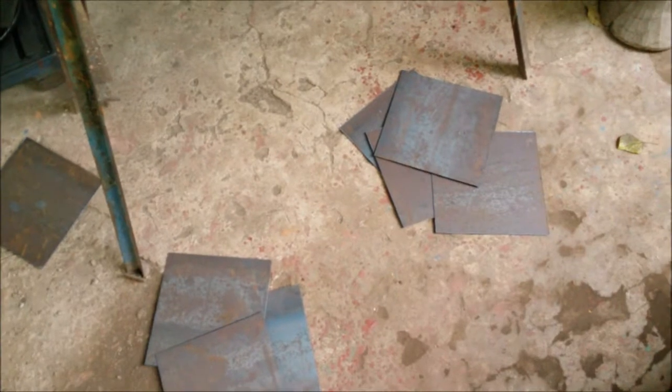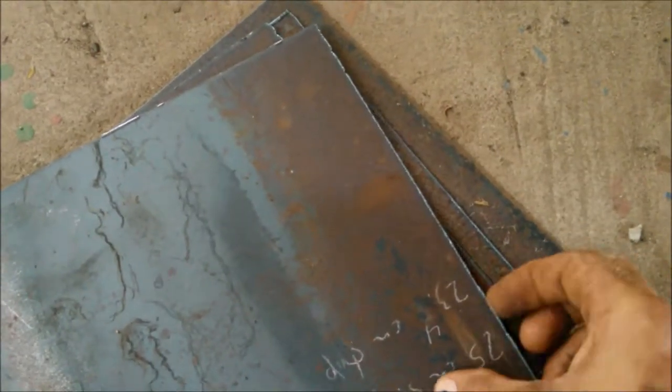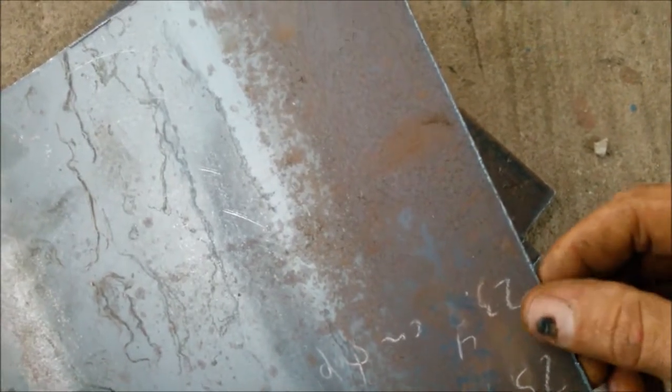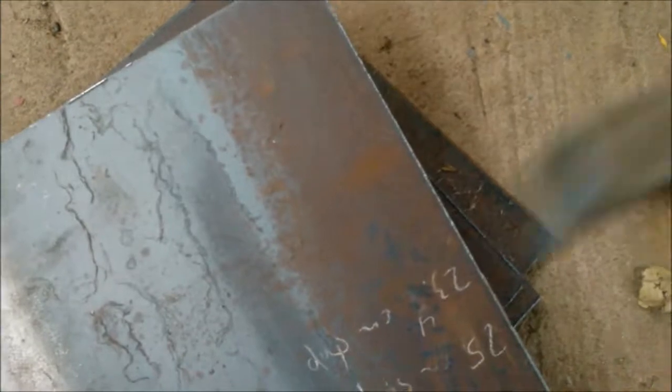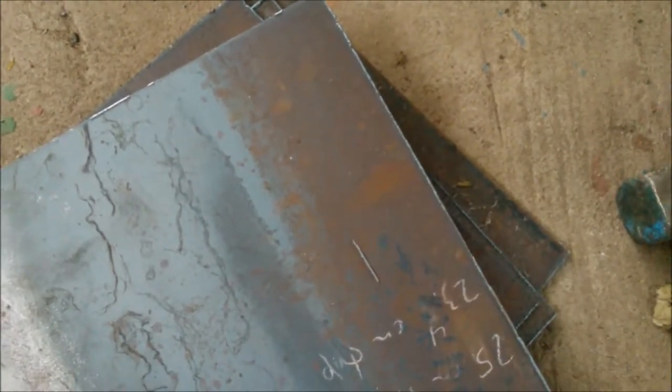The last one. So 4 plus 4 — 8 sets of 8 squares. Perfect. Now I just have to cut out the corners. I was cutting a little slow on a couple of them, and the tip is both Chinese and old, so I got a little bit of dross right there. But just conking that with a hammer like that just brings it off nice and easy.